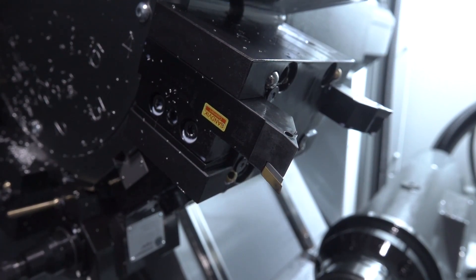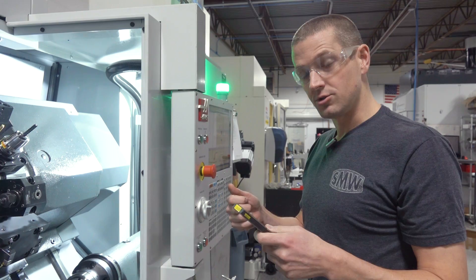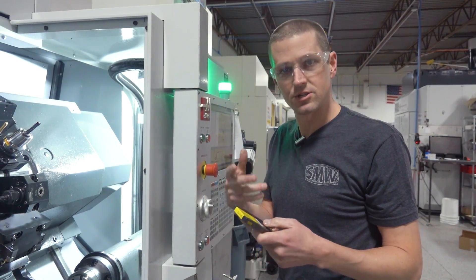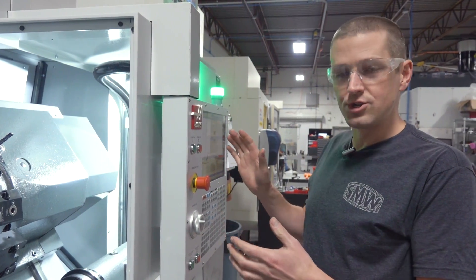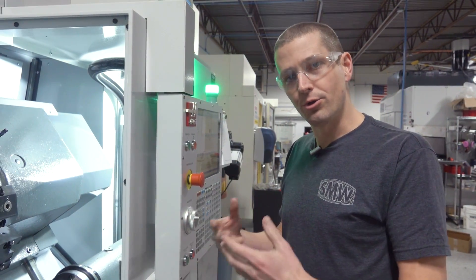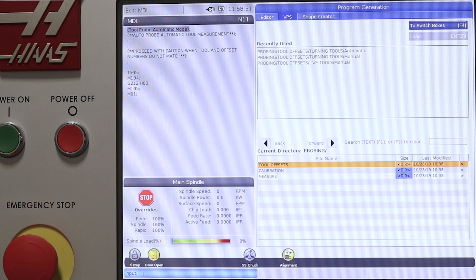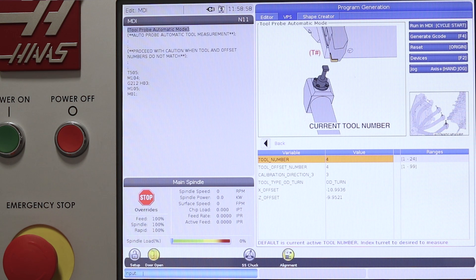I love the fact that the Haas version is totally automated. I just changed up my VBMT finishing inserts. Let's say I want to double-check the tool measurement, or if I rotated an insert and I just want to make sure I'm absolutely spot on on my finishes and tolerances — the insert won't have moved that much. So there's no reason I should have to re-jog manually back over, redeploy the probe arm, and go through that work. It's all automated. Watch this: go into our VPS, tool offsets, turning tools, automatic. It recognizes what tool 4 was previously programmed as, and so long as I've only rotated the insert — meaning the stick tool itself hasn't changed location — I'm ready to hit cycle start.